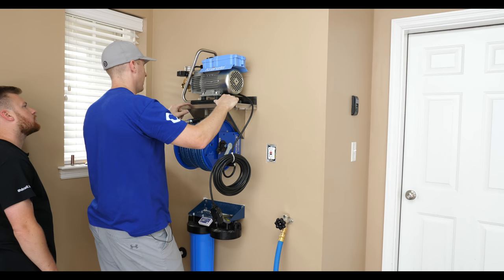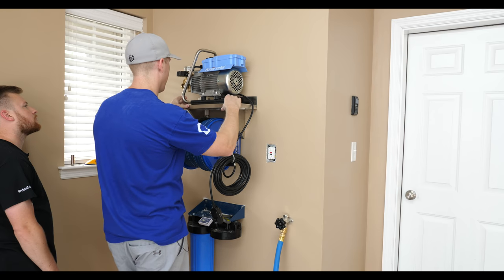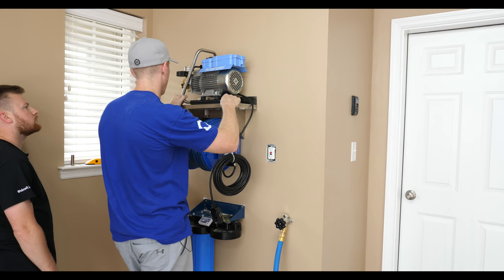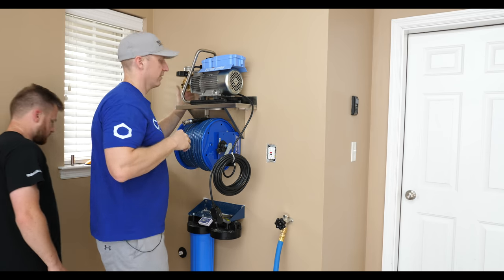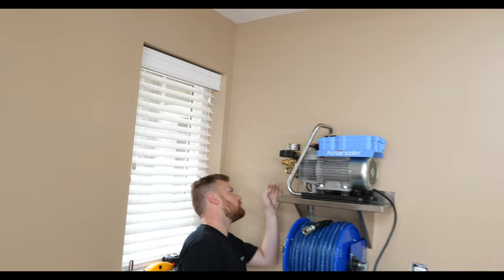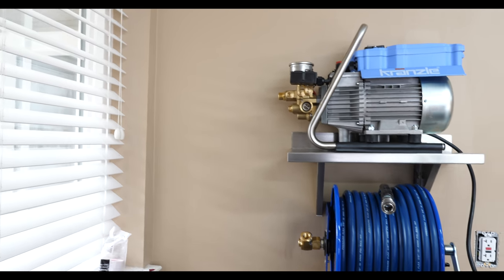Yeah. So we're going to put anti-vibration clamps on here to keep it from falling off the shelf. But I wanted it to sit somewhat flush. So I didn't want to do a 10-inch shelf. I wanted to stay with 8. Mm-hmm. And so you just kind of eyeball it into position. And then notice I've got a finger gap. So let me show. That's about what you need? So that's what, about a half-inch gap? Yeah. We can probably butt it in a little bit. I was going to ask what the gap needs to be.